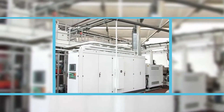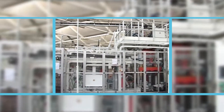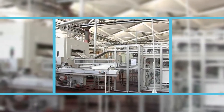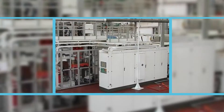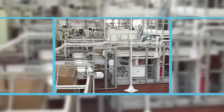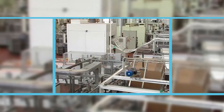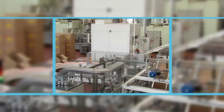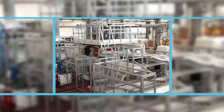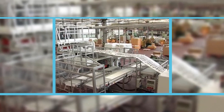OMV Machinery presents its new third-generation model, the automatic F87 thermoforming machine. This machine ranks amongst the top largest single-station in-mould trimming thermoformers available worldwide, with a forming area of 850 by 650mm, a forming depth of up to 210mm, and a closing trimming power of 80 tonnes.